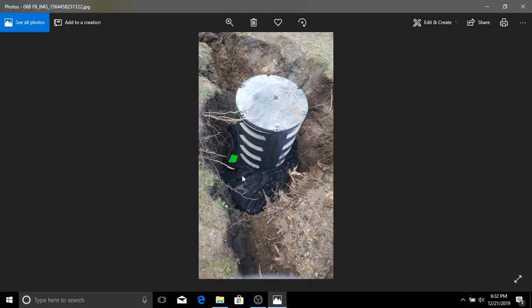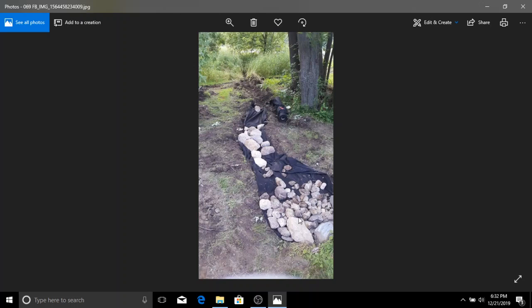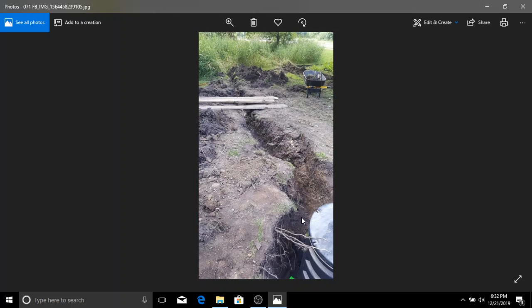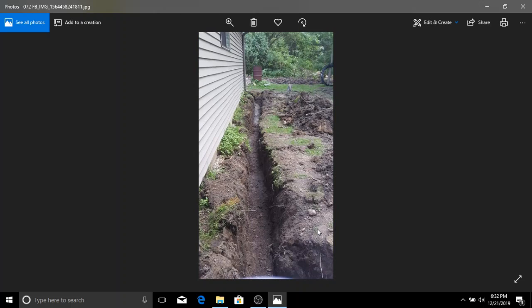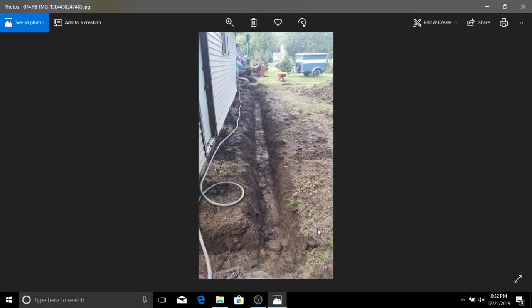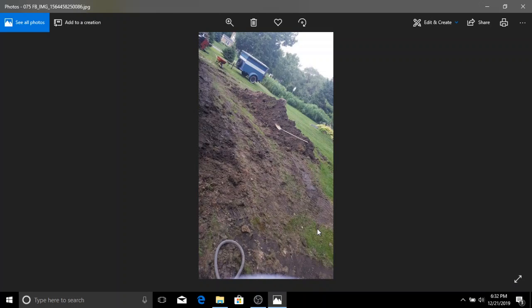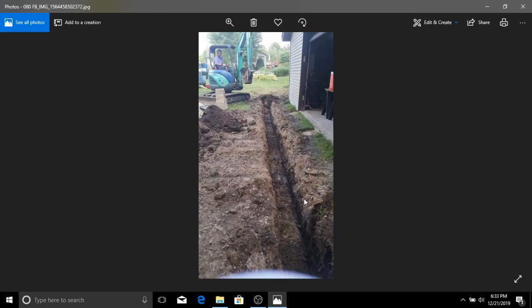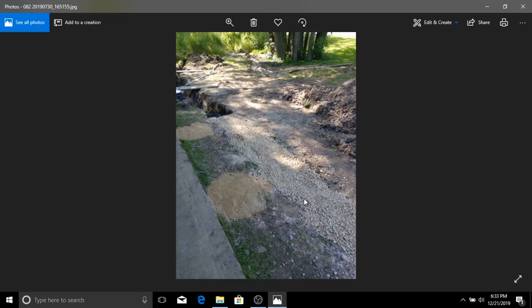Here's an earlier shot of the sump pit as I wrapped up the stone down there — I made it into its own little French drain. A shot of the rock stream in front being built. The pictures are a little out of order because I pulled some off Facebook. Starting to fill it in now — I had it all burrito-wrapped going into the pit. I topped it with three-quarter-inch crushed stone. Here's some of the holes from the garage foundation work where the piers were — I kept well away from those when I dug the French drain.